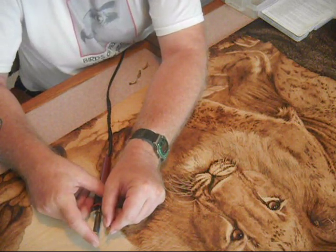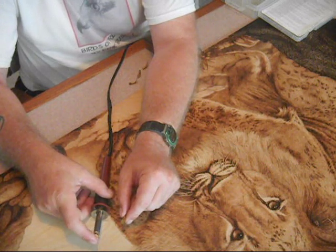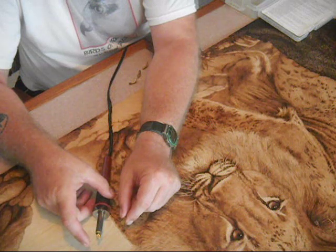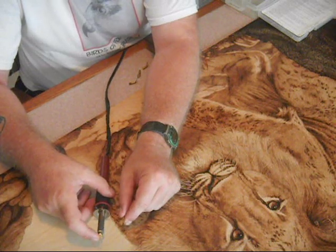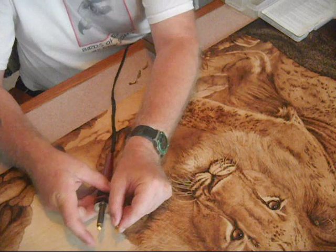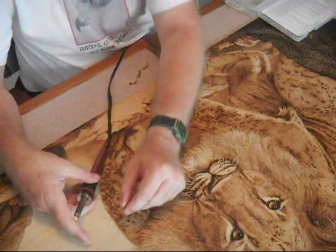What I've done to take care of the heel and point issue is I've sanded it using what's called a contour sanding sponge or contour sanding pad. There are different brands but I prefer 3M — 3M actually uses sandpaper that's been glued to the pad, whereas a lot of them use an abrasive equivalent that I'm not thrilled with; they don't last very long and usually you're burning glue more than the actual abrasive. You can find 3M pads at different retailers or online.